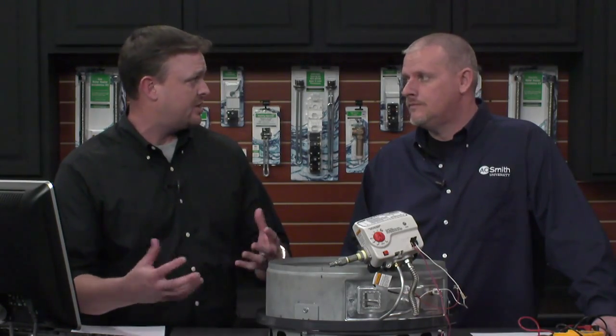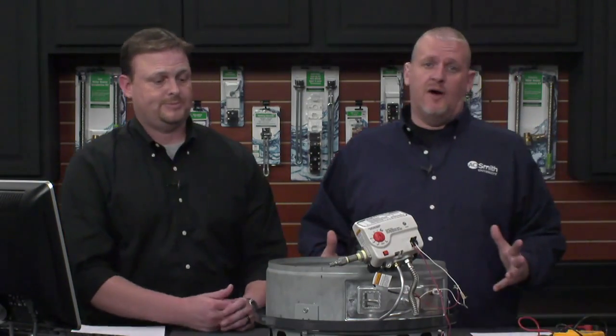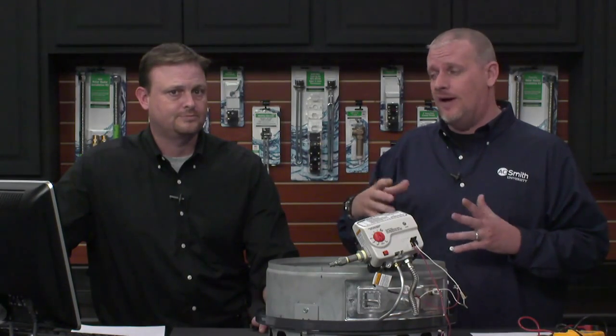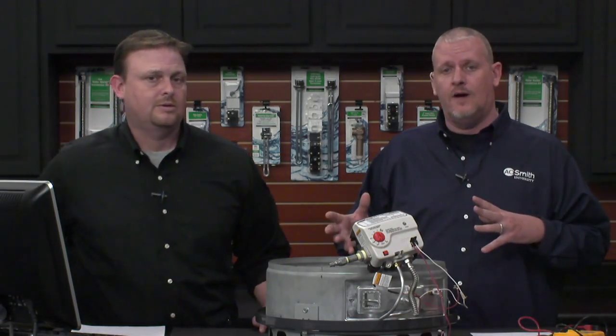The question is: do we make a 10-year water heater, and what's the difference between a 6-year and a 10-year — is it just a kit with an anode rod and paperwork? Yes, we do have both and we will continue to do both. We'll make both a 6-year tank and a 10-year tank, and we will still offer the upgrade where you can convert a 6-year to a 10-year. What happens is you get an additional anode rod that goes in as what's called an outlet anode — you remove the hot water nipple and drop a new anode rod in. You also get a new data plate that transforms that heater, and it's recorded in our system that there's been an upgrade from a 6 to a 10 to extend the warranty.